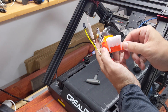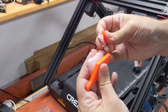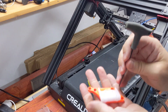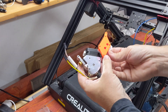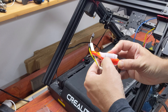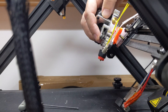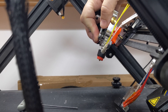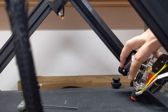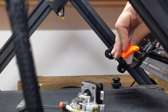Sort of the moment of truth — I've been wondering if the holes will actually line up correctly. Let me get this warm material off. Tree supports, right? So good. These three holes should line up. Those two are very easy to see that they do, and the third one looks good too. I'll give you a better view of this mount: 45 degree angle in the back, 22.5 degree spacer plate. Let's come down to the bed, print on it. Beautiful — just the joy of a CAD model for something you haven't seen before actually fitting on the first time.